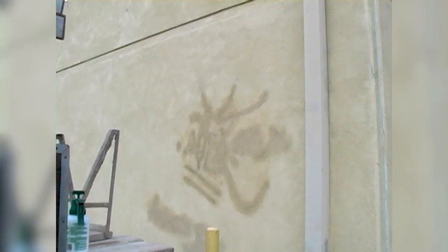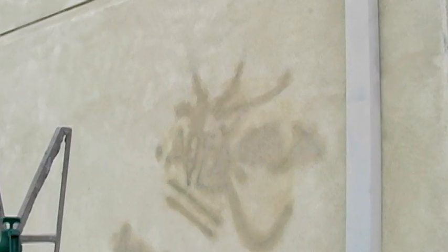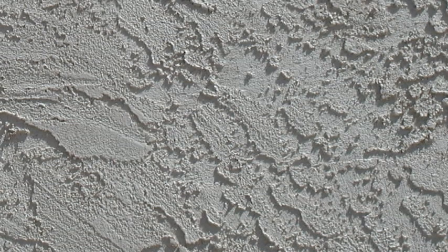During the process of trying to clean the graffiti off of the stucco wall, the customer had inadvertently scrubbed off the sand particles, which made up the sand finish style of texture. So we had to reincorporate those sand particles without applying a new coat of stucco, since doing so with that style of finish would make the finished product look like a patch job. With other styles of stucco finishes, like skip trowel texture and smooth textures, they do not pose the need to apply another coat of stucco.